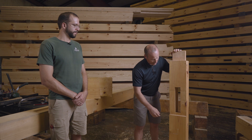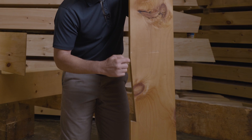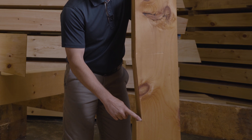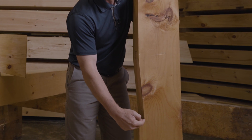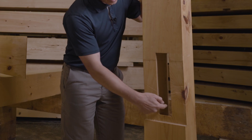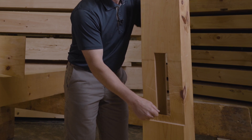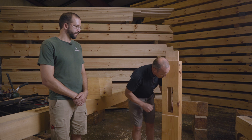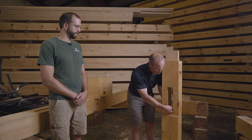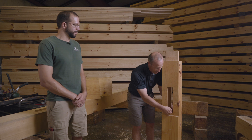What's very confusing about this joint is that we have two different slants. First, on the side we have a taper cut for the beam that starts at 120 inches and runs down to 110 inches — over that 10 inches it runs into the post one inch. The second slant is what's happening on the bottom of this mortise. The mortise height is 111 and a half inches on the front, but on the backside of the mortise this elevation is 110 inches.